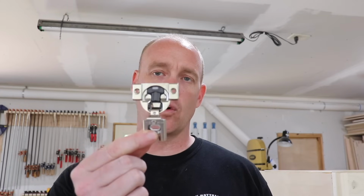There's multiple different styles of hinges that you can use, but for the face frame application, the ones that I like to use the best are these 3/4 inch overlay hinges from Rockler. They're soft close, they have 110 degrees of opening, and they're really, really easy to use. The other benefit is that you can go online or at the store and print off the specifications of these, and I just think it's a nice addition. And one of the reasons why I think that's so important is because of one of the measurements that I'm going to talk about here shortly.